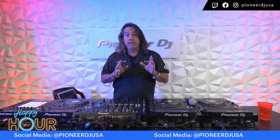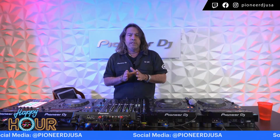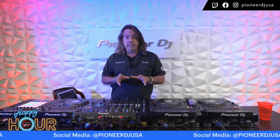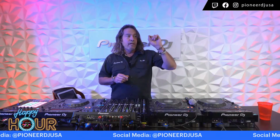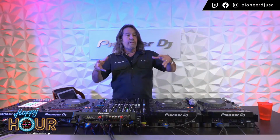Really well received. One of the things they have, if you're a multi-op, where you're working a lot of different venues that I think you're going to love, in the DSP, they have a user program. What you can do is you can set everything on the speaker ahead of time. Get to the venue, dial it in the way you want it, then go to the user program and name it something. Let's say it's a hotel, it's a club, it's whatever. You can have up to 16 of these programs stored so that if you have another DJ or you go to a venue enough times, you can't remember quite how you did the settings, go into user programs on the DSP menu, find that venue, hit enter, and now the speaker will reconfigure itself to the settings that you had when you were last at that venue or that similar setup.